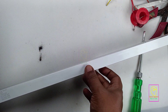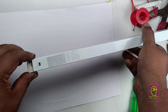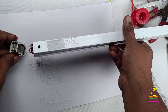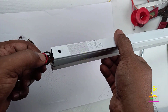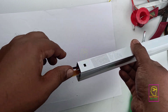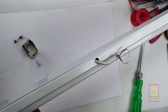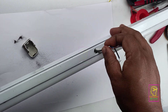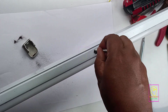This is not an issue because the end cap is already very tight and we can reinsert it without any problem. It is full of dust — I will put a small paper under it to make it easier to clean. This tube has been working for 2-3 years and I am not quite sure how the dust got inside. To dismantle it, you have to gently pull the PCB out — do it very gently, otherwise there is a chance the PCB may break. Also, the main wire is coming out through the center of the tubelight; if we do not push it in from outside, it may get stuck while pulling the PCB out.